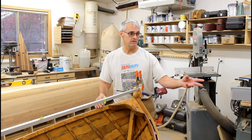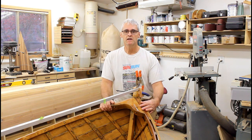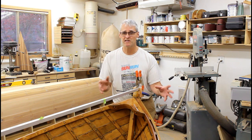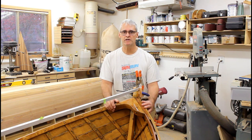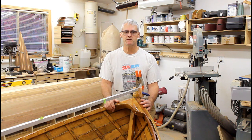Now that I have five rough patterns of the various 18-inch spacing placements for the forms, I'll take those to a workbench and roughly draw them out on a large piece of paper to create a sort of body plan view. It's very rough — we'll take some numbers and create a table of offsets. I think that's going to conclude episode 2 in this series of videos on taking lines from the little Ken Douglas. Thank you very much for tuning in — consider becoming a subscriber or hit that bell button to be reminded every time a new video is uploaded from Worker Boat Shop.